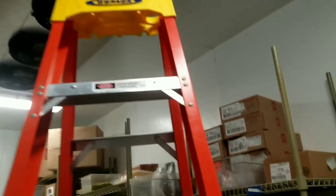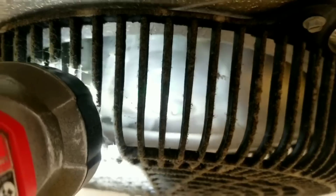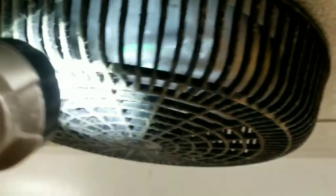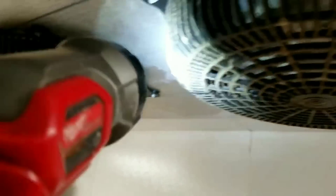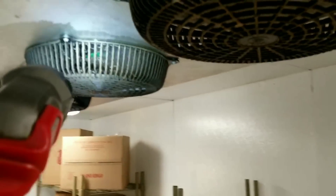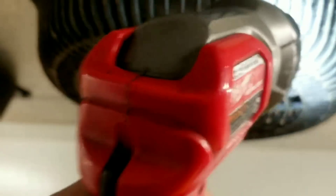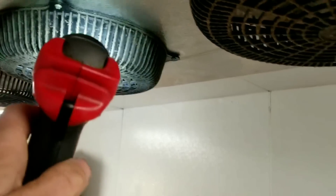There's a little bit of frost on the coil, not terrible though. Looking through this fan blade, the evaporator is clear and clean - a little bit of dirt but nothing that should keep it from working. Our finger guards are pretty dirty though, so we might pull those off and clean those today. First we'll get to the major issues and then we'll get to the cosmetic issues.